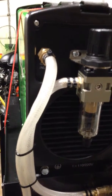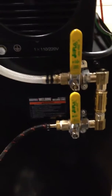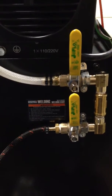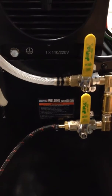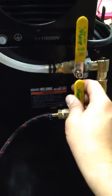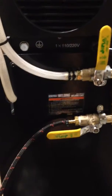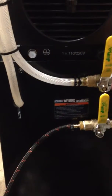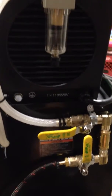So I came up with what I felt was a real good remedy for that. I spent about 50 bucks in brass fittings and valves, and what I did was I took a T, put it through the back side of the casing here, and hooked up the hoses proper. So if I want to TIG, all I have to do is open my valve and it will automatically feed through and go right into the unit. If I want to run the plasma, all I have to do is turn on my air, plug in my hose, change the connector up front, and pop on the plasma head, and it's good to go.